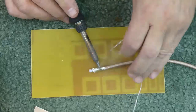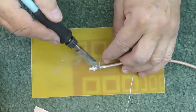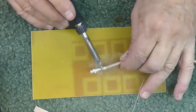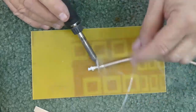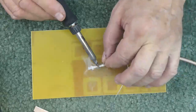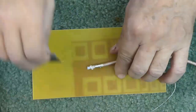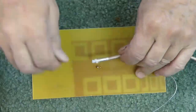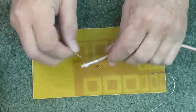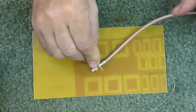We tin it where we want to cut it and get a good layer of solder on it. This is after we push the braid back and bunch it up a little bit. I'm going to flood the braid with solder just out in this area, not back up under the jacket. I'm working on a piece of fiberglass so I don't mess up my bench. Then what we have to do is go around the solder and score it.